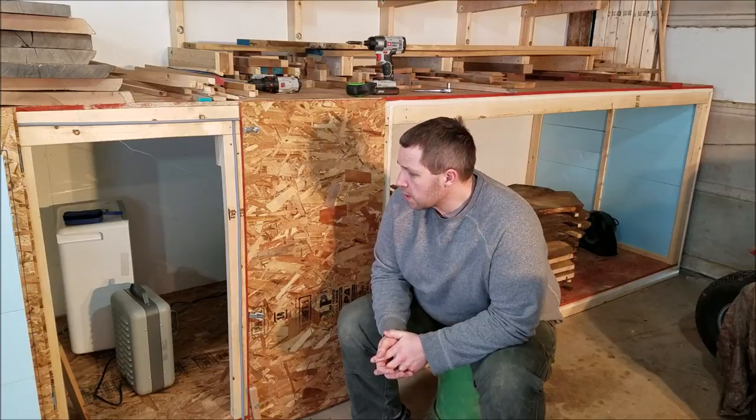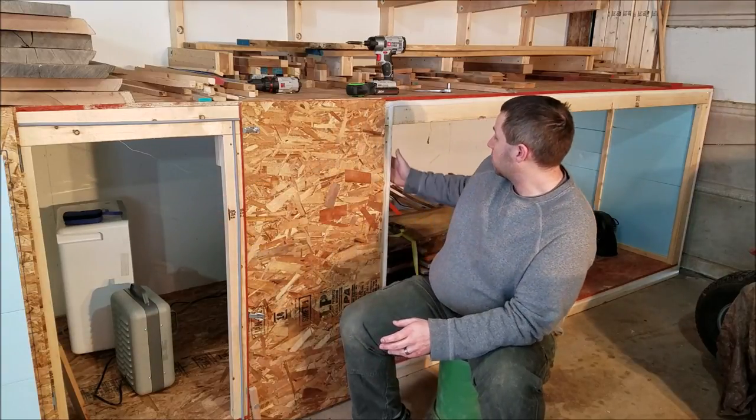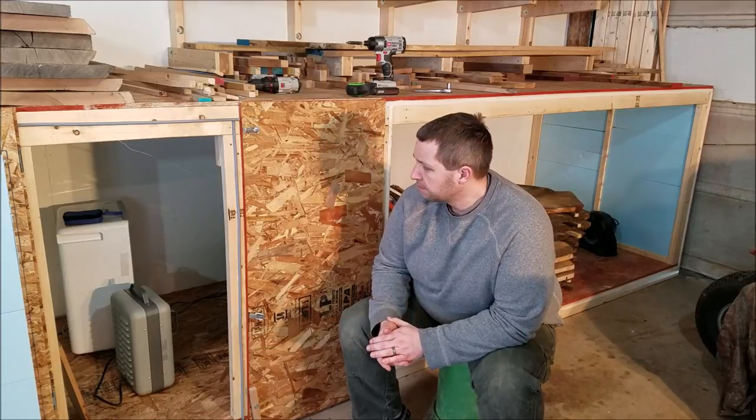As you can see, I got it completed. I got my first load of lumber in here — it's about 150 board feet of red oak. Some is cut to 4/4, 6/4, and a little bit of 8/4, a couple of 8/4 planks in there. The insulation was all put in — I did most of that off camera. It's an inch and a half of Dow XPS insulation, which is a closed-cell insulation. I put it on the door and this larger door opening over here. There's an adhesive specially made for it — about $5 a tube — and I only needed two tubes.